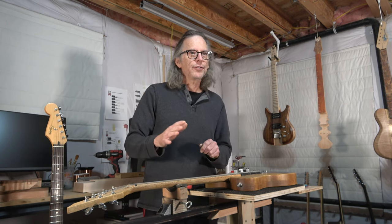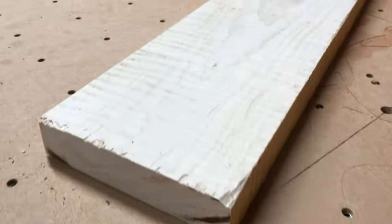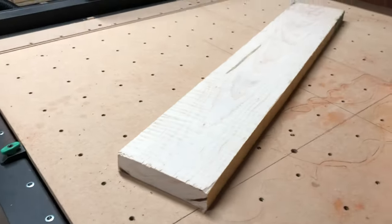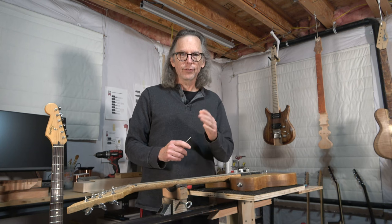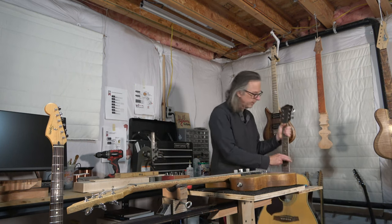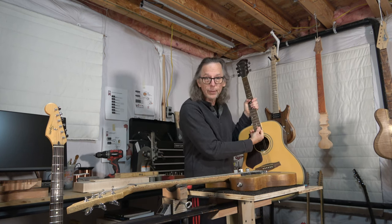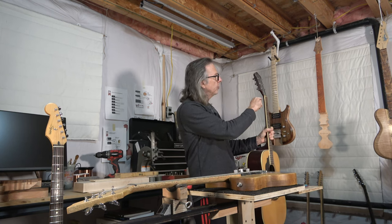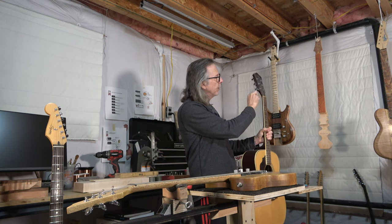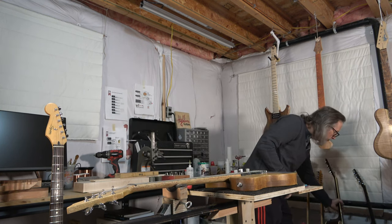However, if you do a lot of research, you'll notice that most of the necks that break are mahogany necks. If the neck is made out of maple, it's not as big of an issue because maple is plenty strong and can handle having a little bit more wood routed out in that area. Mahogany, not so much. That's one of the reasons why on acoustic guitars the adjustment nut is located not at the headstock but in the sound hole — because the necks are typically mahogany and are much thinner and susceptible to breakage. So in order to prevent routing out too much wood and weakening that spot, they flip the truss rod around and have it accessed through the sound hole, making for a much stronger headstock-to-neck joint.